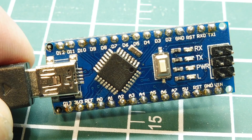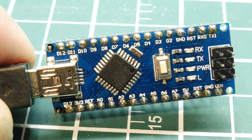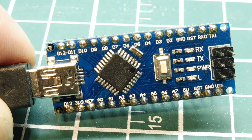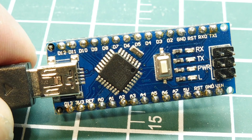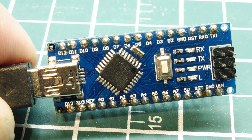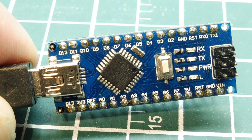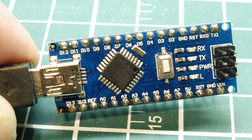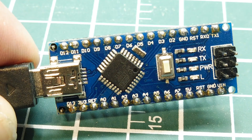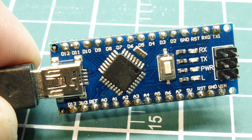If your project will be used in a harsh temperature environment, it's good practice to monitor the internal temperature of the microcontroller to keep it within its limits. If the temperature approaches the limits, you can use your GPIO to turn on a heating or cooling source to bring it back into range. If that's not possible, you should go into a safe shutdown — if the microcontroller is controlling a machine, shut it down safely first, then shut down the microcontroller itself. Having the ability to monitor internal temperature lets you shut down your project safely.